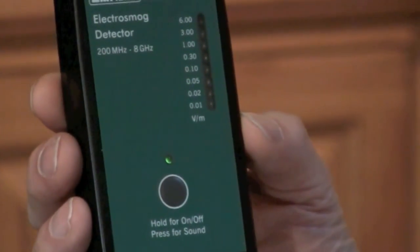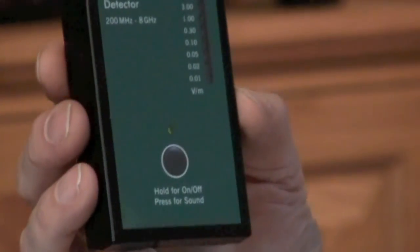So you can do this wherever you are. Take the meter around, see if you can find sources, try to unplug those sources or remove them. Sometimes you'll find the fields go up as you go near the window. If you find that it seems like it's coming from the outside, then go outside — and typically it'll get stronger if it's from the outside when you go out of the house. Sometimes I track down a neighbor's router, for instance, by going outside the house. And I find it's the west side of the house that has this chop-chop-chop — that sounds like a router.